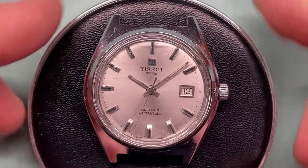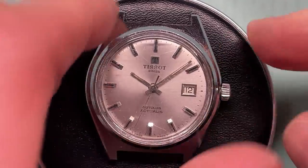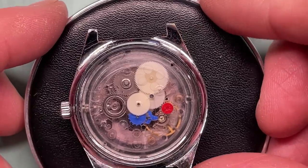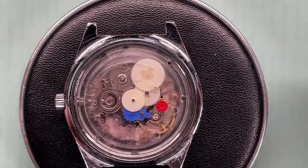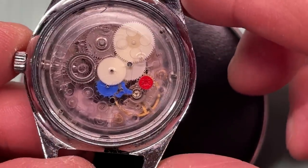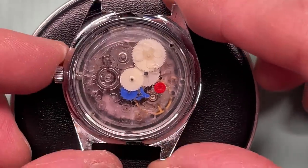What is inside this? What's so significant and fantastic and weird about it is that most of the working parts in this movement are plastic. There isn't a screw inside there and it's only got the keyless works, the barrel, and of course the hairspring and the balance that are made out of metal.